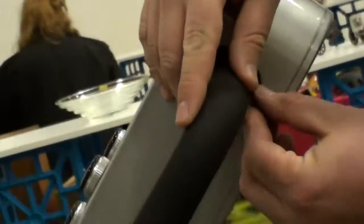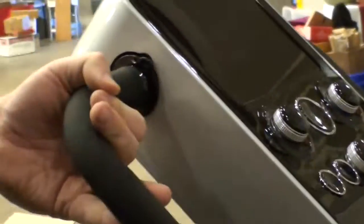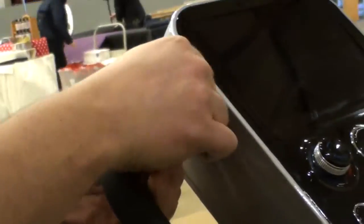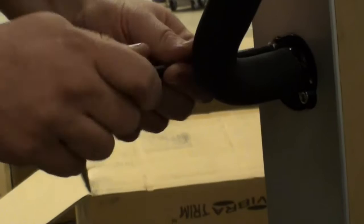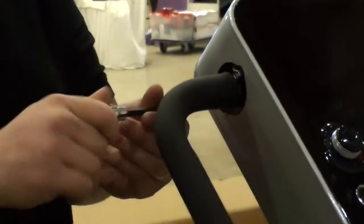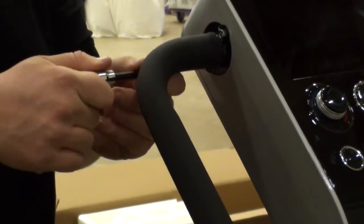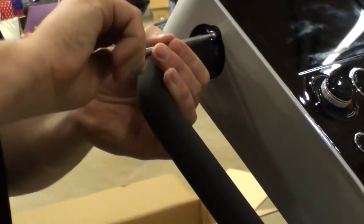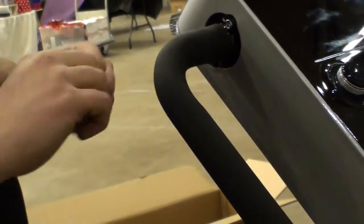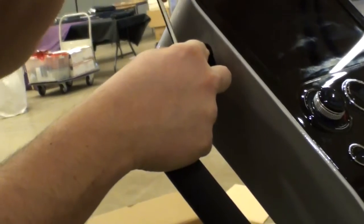Once all screws are threaded in by hand, then you can tighten them. Another trick is that you could take the end of the Allen socket and use it to help you hand thread them in. Use the middle-sized Allen wrench that came with the kit to first tighten them down with the long end, and then switch to the short end to get a little bit more torque.